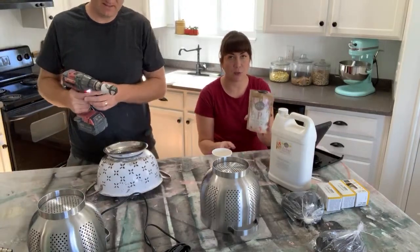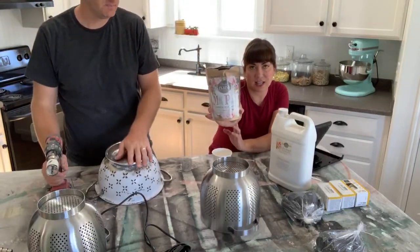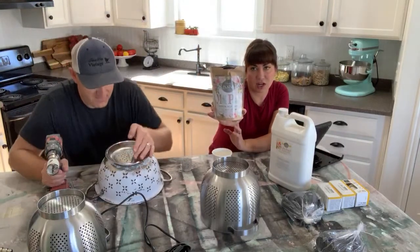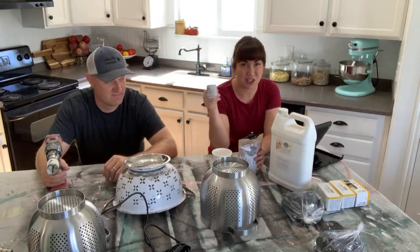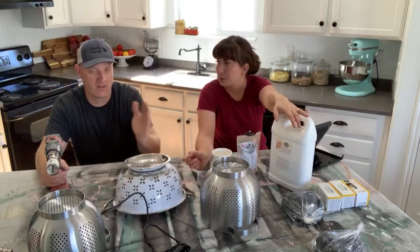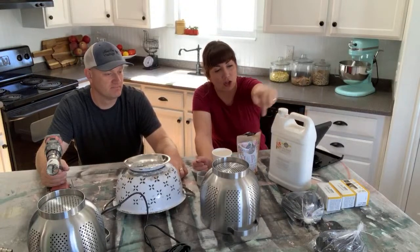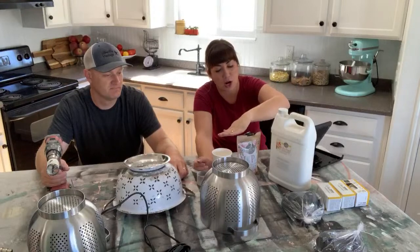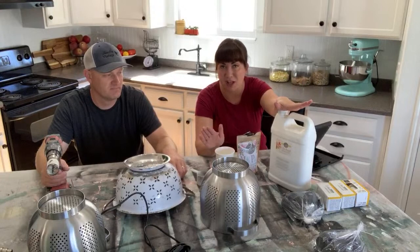So while he's doing that, I'm going to tell you what I'm going to be doing. I've got Sweet Pickens Milk Paint in Lantern — you can pick this up at jamierayvintage.com. I'm going to mix one part milk paint to one part warm water. I like to use my protein scoop because it fits nice down in the bag. It doesn't really matter what size you use as long as you're one-to-one on the water to milk paint. Because we're painting this shiny metal, we're going to want to add Extra Bond — that's two parts of the mixed-up paint to one part bond.